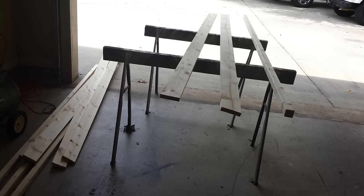I used plywood and 2x4s — basic wood from the local Home Depot. I tried to stay inexpensive but got nice quality wood because I didn't want particle board. Be aware that particle board is hard to cut with a table saw since it can break apart pretty easily. Plywood is a safer bet. It doesn't give you a great natural wood look, but you can apply a stain to make it look really nice. Go with 2x4s and sheets of plywood — I think I used one 8-foot by 4 or 6-foot sheet.